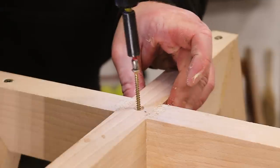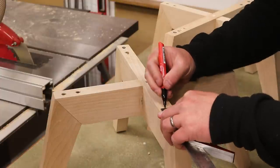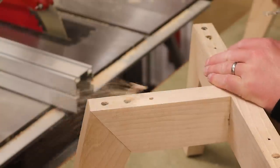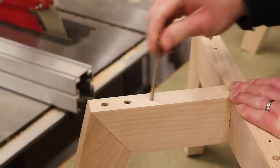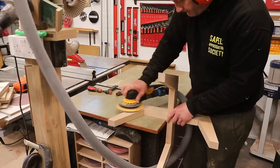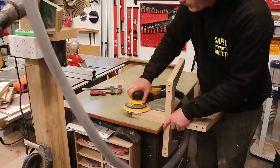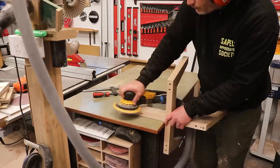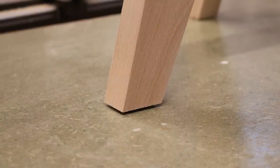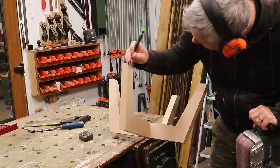Not really necessary but I'm going to add a screw at the half lap anyway. I then drill a pilot hole through each leg to secure the leg base to the cabinet later on — I want the screws to be a loose fit in the legs so the head of the screws can really cinch it down tight. I really should have sanded these legs before doing the joinery. I can check for level on a flat surface and they're about three millimetres off, so I'm using the belt sander to make small adjustments to the end grain of the legs to get them sitting nicely.